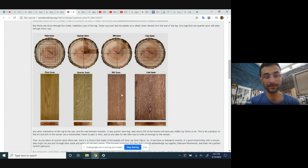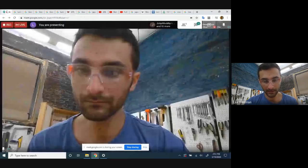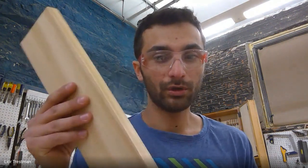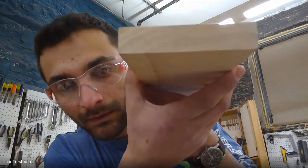After milling into planks, you have to let the wood dry. When you cut it, wood is green and green wood is not great to work with — it can crack as moisture evaporates and it can warp. You sticker the wood: take those long planks, put sticks in between so air can flow, and let it dry. Some people do that in their backyard over a year or two, with the wood stacked up and stickered, covered from rain but exposed to the environment.